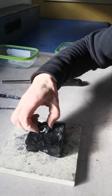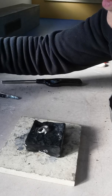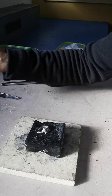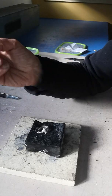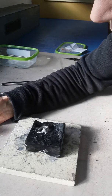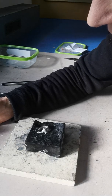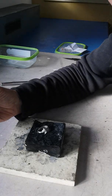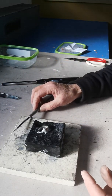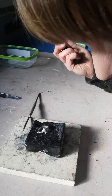I'm putting flux on the copper plate as well. I've put a bit of flux onto my scribe, which I just reserve for this purpose, and I've cut some rather large pieces of silver solder. This is easy flow solder — the easiest flow you can get. I use the sheets; you can use many other things but I've always used sheets.